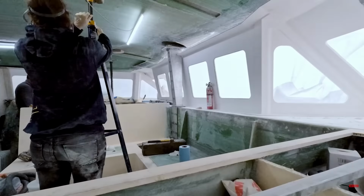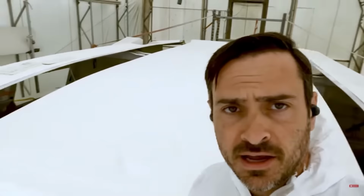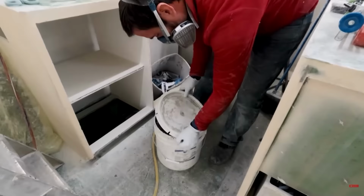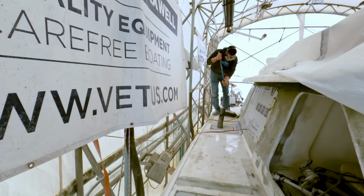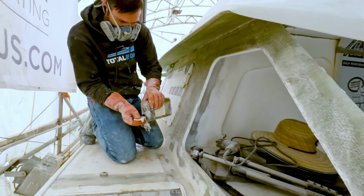This past fall, with the last little bits of warmth, we were able to finally bond down our cabin top, which originally had arrived to us in three separate sections. While temperatures were still above 60 degrees, we used our methacrylate bonding agent to glue it to the flanges of the cabin sides. Now that we're headed into spring and are once again experiencing the odd warm day here and there, it's time to glass the two pieces together on the exterior.